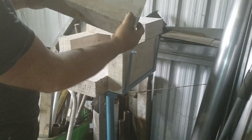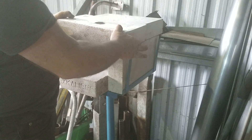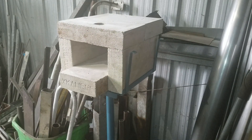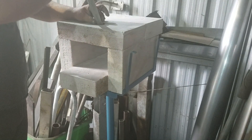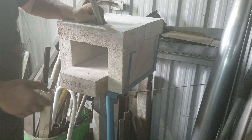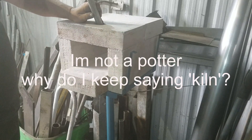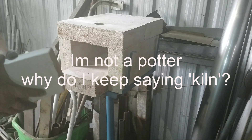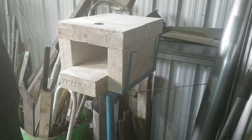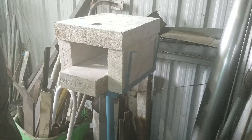You'll see I've put a hole through this brick — it's very easy to do with a hole saw. You can cut this material with a hand saw, a hole saw, or carve it — it's great stuff. The burner will be assembled on an angle, going down through a tube into the chamber, directing the flame towards the back of the kiln so it swirls around. It won't be the direct flame heating the steel — it'll be the general temperature inside the kiln, which gives more even heating. The kiln is open at the back, so if needed I can drag it out and put long pieces of bar right the way through. An off-cut brick will block that up and provide faster heating when not needed.